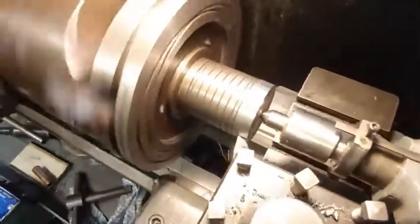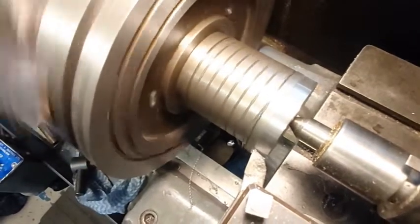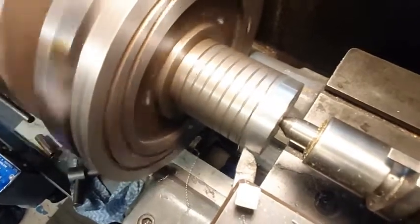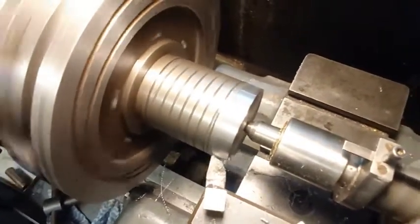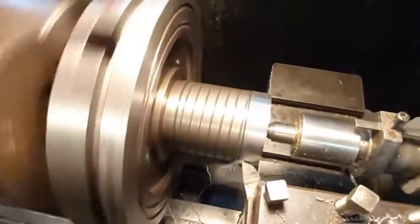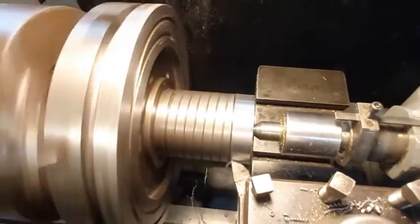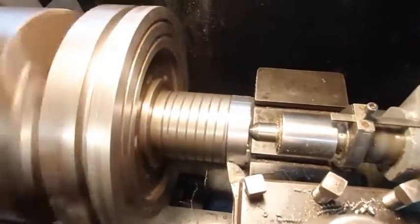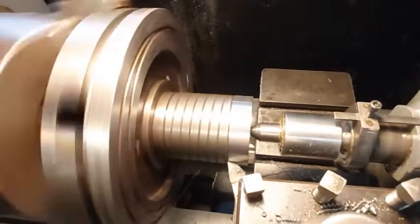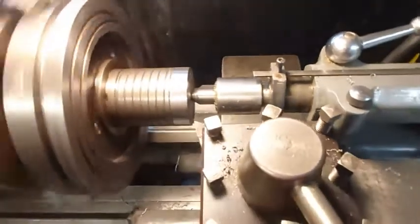You may notice that the turning tool I'm using is a brazed-on tip onto a steel shank. I make my own tools — I have done for years. I rough grind them on green grit wheels and then finish grind on diamond wheels. I don't use throwaway tips; the only throwaway tips I use are my parting tools. I've used this method for years and always found great satisfaction — I've never had any problems with them. They always leave a decent finish.